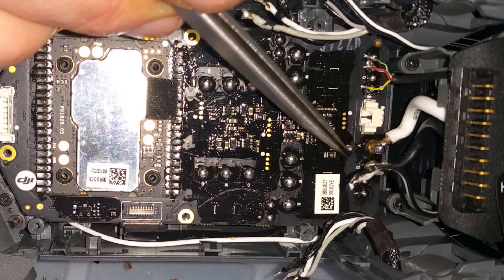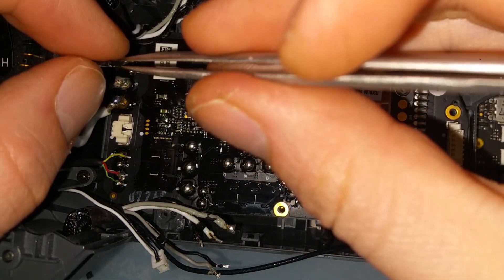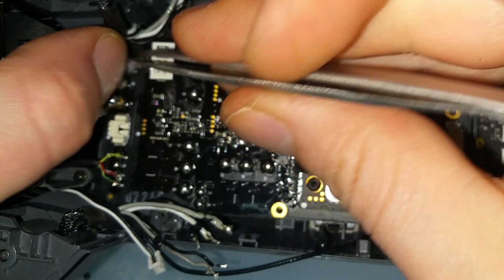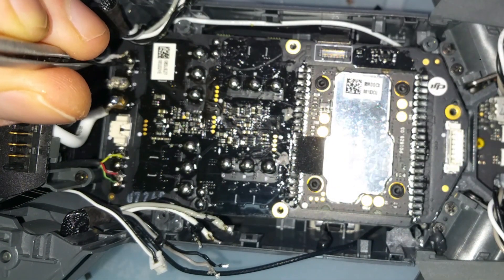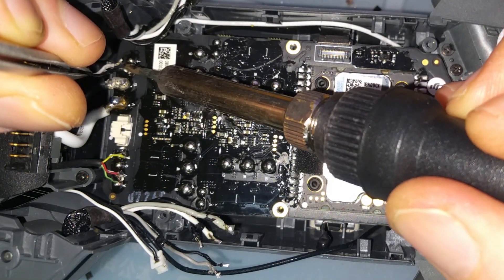Use fresh solder as well to make it easier. I think I use 340 Celsius for soldering at this point. And as you know, 240 is the melting point of solder, so it's not possible at that temperature on this one. I need to use a much higher temperature, because there is also some protection on top. You can see on the board the shiny stuff — that's protection. Also, because the new board has protection everywhere, it's like a lacquer on top for water protection. But definitely it's possible, don't worry, just make everything as before.